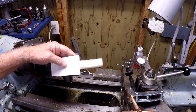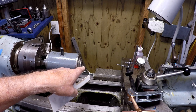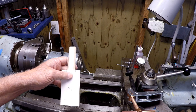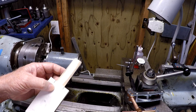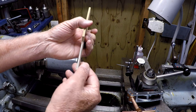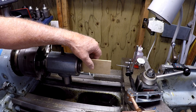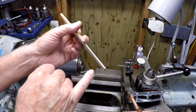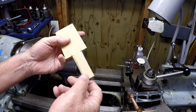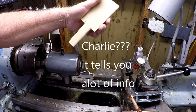The second thing I did is I made this little crude tool. Measured the bore at the front with a telescoping gauge, my best ability to measure down in the bore at three inches. Did the math and drew the taper on this piece of quarter-inch material. Then went over to the belt sander and tried to come up to pretty much a knife edge in the center. I chalked the edge, slid it in — pretty tight — and looked at where it was rubbing on the chalk marks.